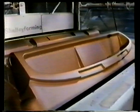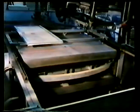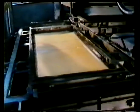Vacuum forming can be adapted to shape very thick sheets of polymer. This sheet of acrylic is 8 millimeters thick. You need more than atmospheric pressure to form sheets as substantial as this into complex shapes. The acrylic sheet is heated, but the temperature of the ceramic heaters has been varied across the surface of the material to optimize its flow as it takes up its new shape.